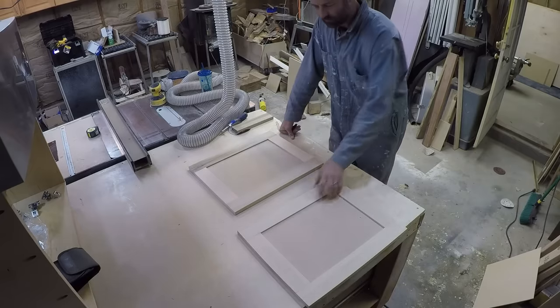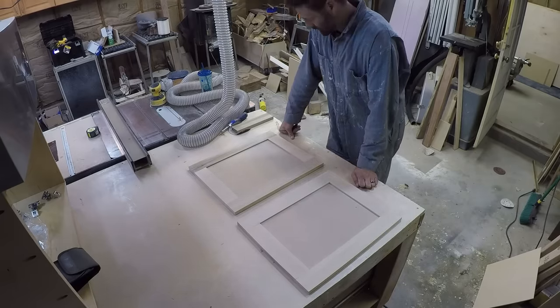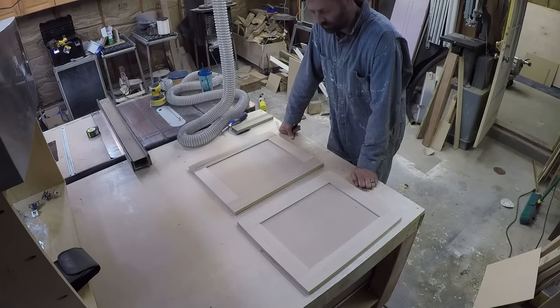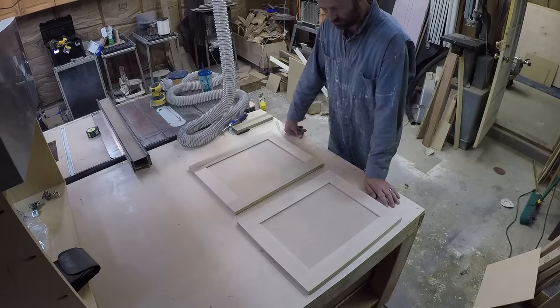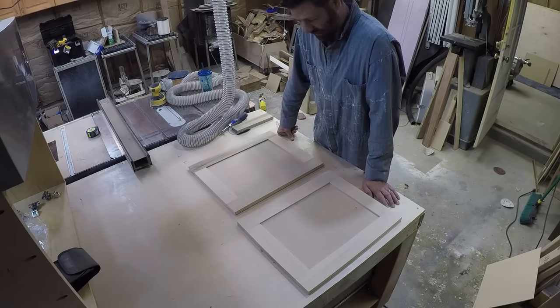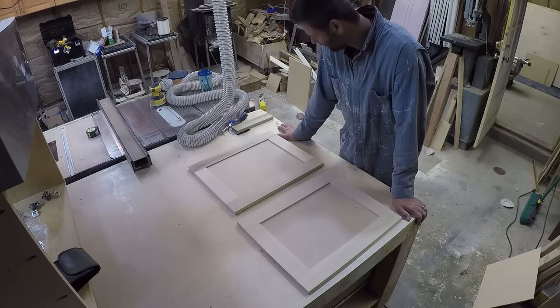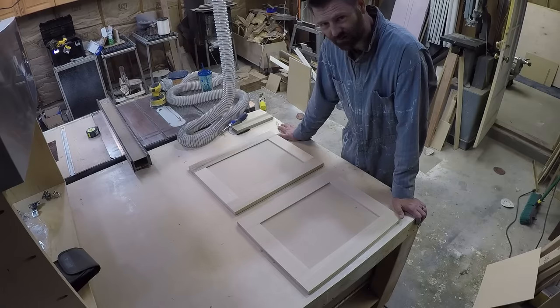Tomorrow. I would do it tonight, but I'm a little low on lacquer thinner, and the first coat has to be diluted down quite a bit so that it soaks into the wood. So I'm going to get some fresh lacquer in the morning, and I will spray these with the new spray gun. Yes, I got a new one. I think you're going to be impressed.